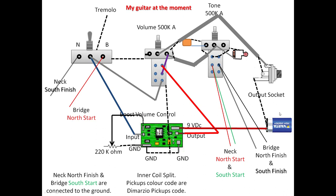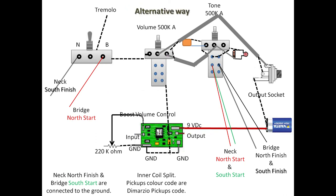This is actually my guitar at the moment — I'm still using the ground connection here. When I recorded this, I've had it for a year and it's totally fine. An alternative method: take the output to this point, connect both points together, take this one to the volume, then take this point to the input and the output connects here. When you press the push-push down in normal case, the gray connects to the violet and goes out — totally passive, the boost circuit is not in the circuit at all.